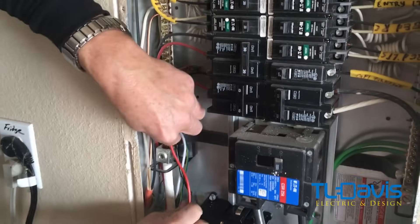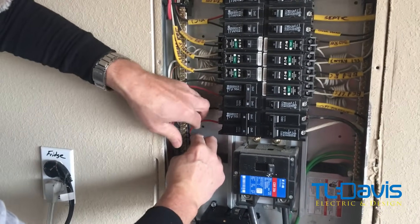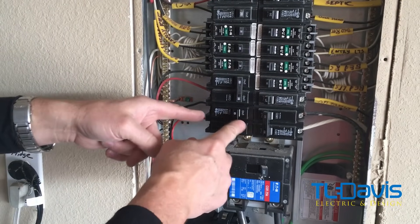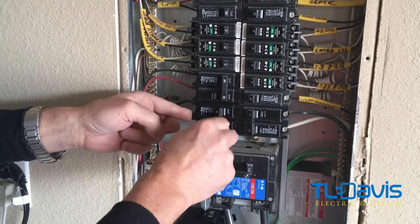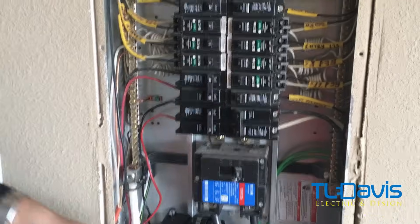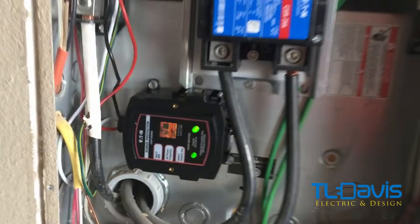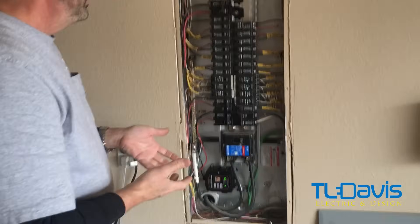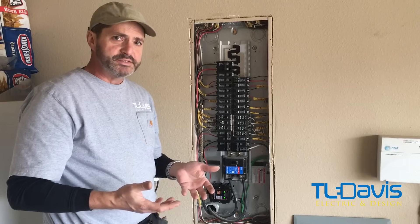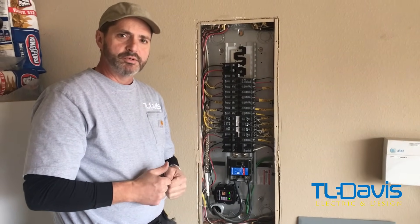We're going to clean this up a little bit and make it look better. Now that it's installed — if it's in trip position, you have to turn it all the way off first. See how I put my finger here and here — make sure it's all the way off before you flip it on. If you look down there, the green lights are on, which means you're good. Your home protection system is installed and working. The only thing left is to put the cover back on. If you have any further questions or videos you'd like to see, please email us, give us a thumbs up, and let us know how we're doing. Thank you.